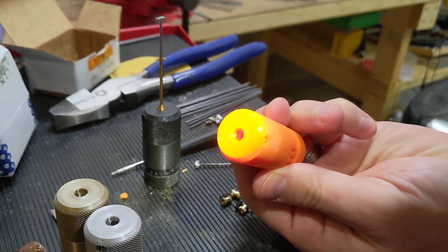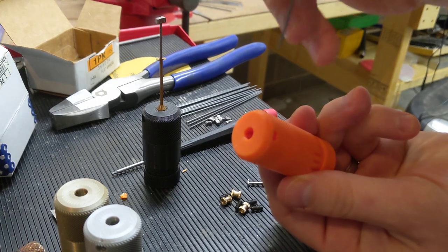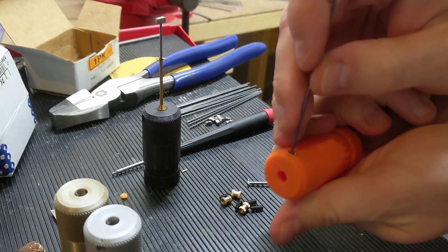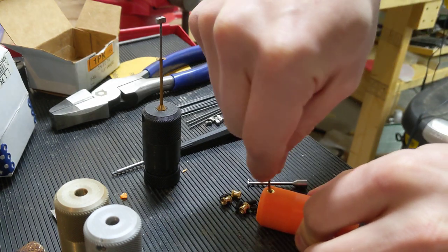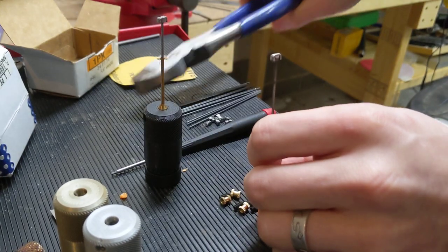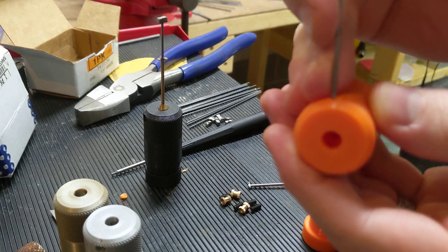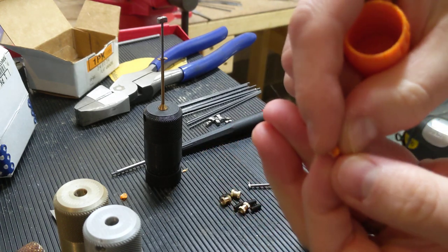The other work besides sinking in your inserts is to basically take your tensioner or some other scraping element and dig that plastic out of there. If you do it when it's hot it's a little bit easier, but you can also poke your tensioner straight through the top to get it started. Or give it a little tap, or use another small pointy element. That basically clears it out — it went all the way through to the other side so I can just poke it out and dump it. That's what was lodged in there behind the threads.